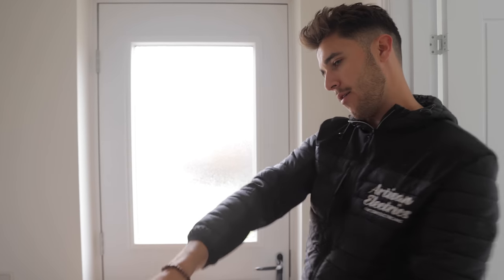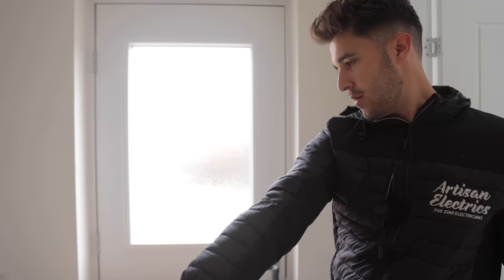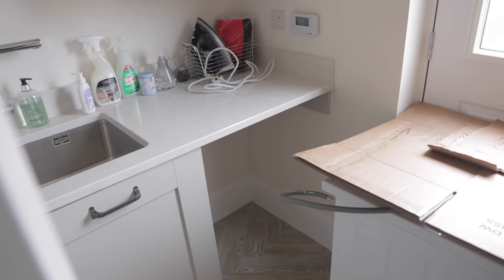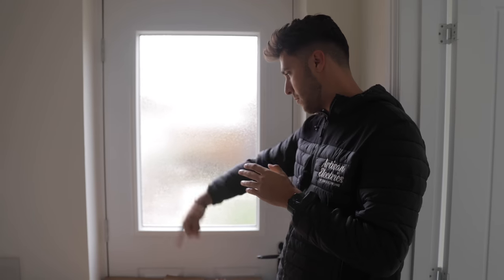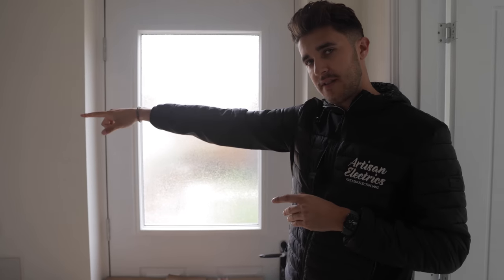Swing my chain until it catches on the magnet, pull that magnet out, so then I have a route to that corner, trunking just above the skirting, all the way along. We can put the appliances back in, pop out that wall. You'll never know we've ever been here on this side. No damage, no cable on show. And then on the other side, we can pop down in that duct, and go inside the house. However, there's almost definitely going to be noggins and stuff in that wall. So what I'm thinking is, we get permission to turn the power off, we safely isolate, and then we get our little arms inside that wall.